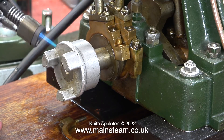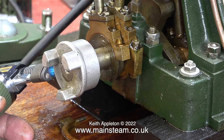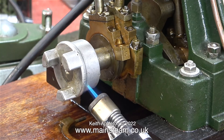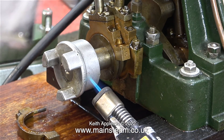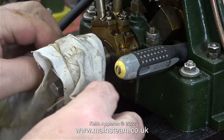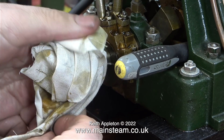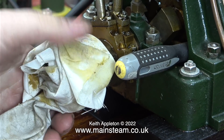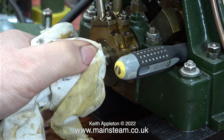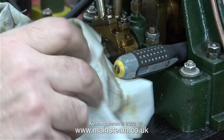At first I thought I should just heat it up a bit more, so back to work with the blow torch — and now it was very, very hot because I did actually burn my fingers on it. I kept the heat on the work for quite a while; this is only a small blow torch but it's surprisingly hot. I kept moving the blow torch around to each side to thoroughly heat the part, which now should be more than hot enough to slide off the crankshaft. I doubly wrapped the part using a piece of cloth but it still did not come away. It did rotate and move further towards the eccentrics but would not come off the end. Note the use of a rubber-handle screwdriver to stop the crankshaft from rotating — always a good idea, because if you use a solid piece of bar it can mark the parts, but the rubber handle screwdriver is quite harmless.